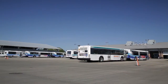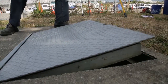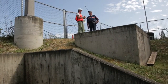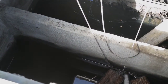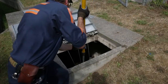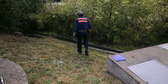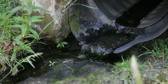Inspect the overall structure of the vault. Remove debris, check for sediment buildup, and check for cracks in the concrete structure. Never enter the concrete vault — professional contractors must have a special confined space certification. You might be tempted thinking it will be faster or cheaper, but it's not worth the risk. Also inspect the discharge water: it should be clear without a visible oily sheen. If the discharge water is oily, your oil water separator needs to be cleaned and maintained more frequently.